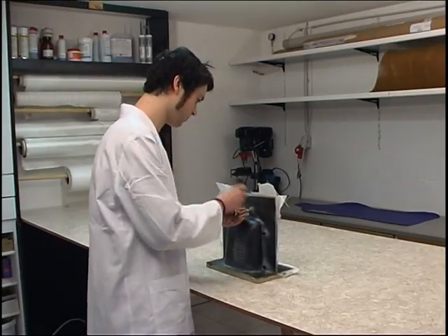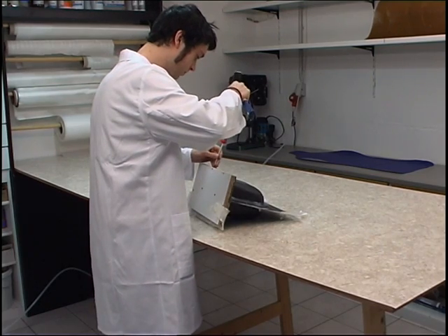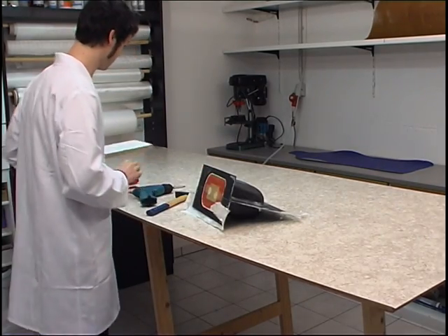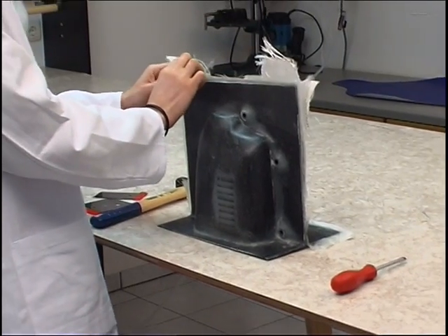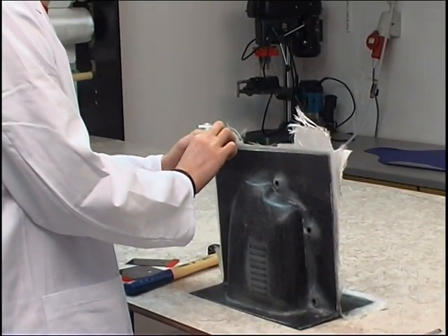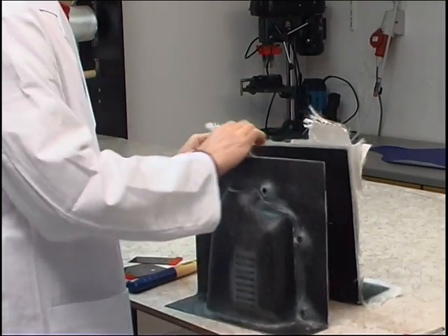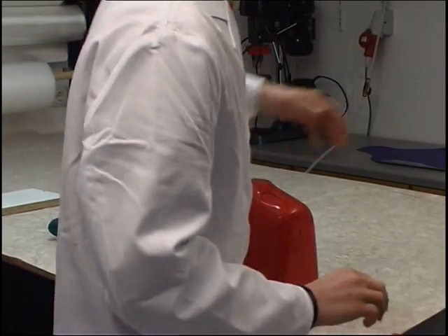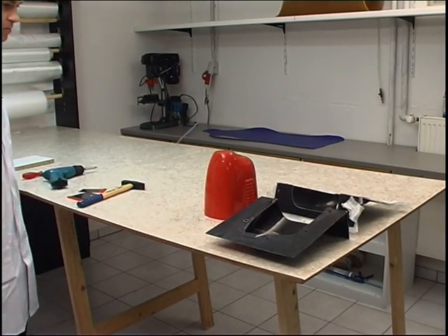Before the molding, the two mold halves must be left to thoroughly harden. The earlier the molding, the greater the risk of mold distortion. Please also bear in mind that the resins harden very slowly at temperatures below 20 degrees Celsius. We recommend storing the molds for at least three days in a warm room before molding. After loosening the centering screw unions, first separate the two halves carefully at the edges. Owing to the thorough application of film release agent, the molding should not cause any problems whatsoever.